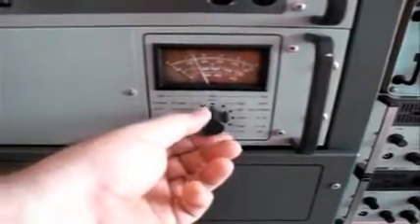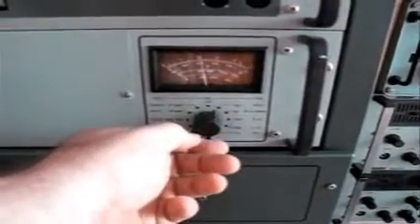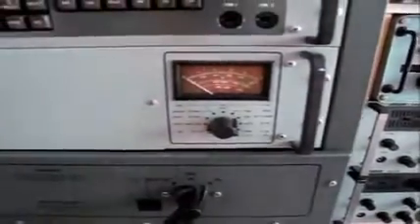In fact, if we just run through the drive — 300mA, 3kV, and we even have some grid volts there. So the normal procedure next will be to tune the transmitter up on the frequency of choice. In this case, we'll just set the transmitter up on 7MHz.